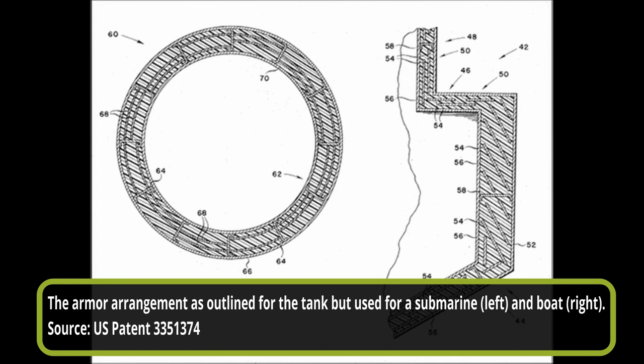As an aside, the Forsyth brothers also considered that this armor was suitable for consideration on ships and submarines. The projected weight for both parts was just 19 to 20 tons for the steel aluminum armor version, and 21 to 29 tons for the composite armored version, depending on the exact composition. The composite armor option was a significant improvement over the original steel and aluminum option, and provided the design with substantially more protection than that of the Sheridan against both kinetic energy and shaped charge munitions.